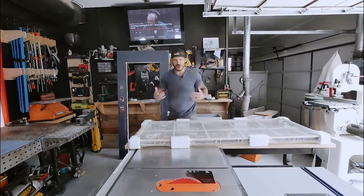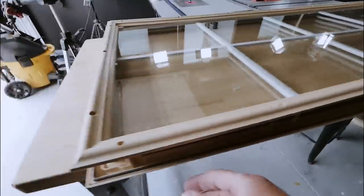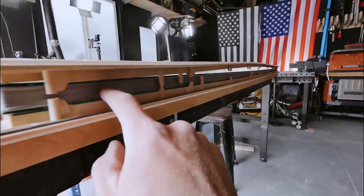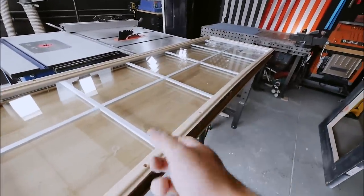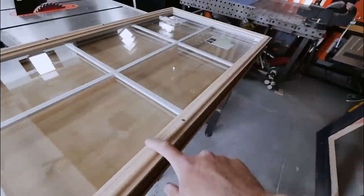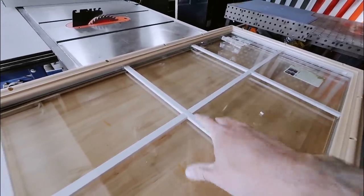Come, my friend, come look. So what it looks like, it's two frames, top and bottom. Both have a weathering gasket sealing there. And then the glass, the tempered glass, right in the middle, that's sandwiched. So basically, once you put a sandwich around the door, you will just secure it with these screws and then cap off these plugs. The great thing is this is already matching our current situation. Let me show you. Nice, the door is open.